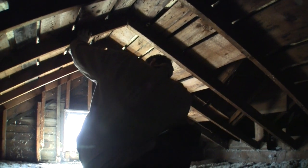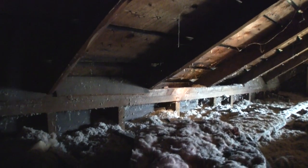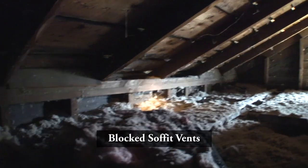One of the things I noticed right away is there's definitely some ridge cap vent in here, but there aren't any real soffit vents — some of them are blocked off. So the whole venting situation is going to be a real key issue to address.